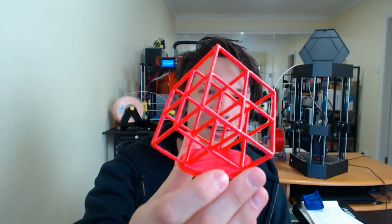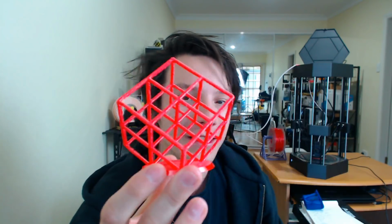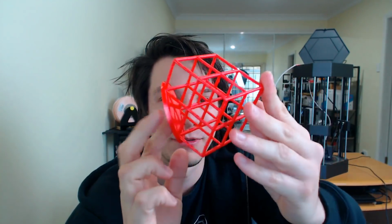Right. So what we've got going is the Flux Delta Plus. And to show you what my previous test was, this was what I got last night. It's better than what I got in the review, but it's still not great. I think the cooling on the Delta Plus could be better, but also it looks like a little bit of over extrusion, which is why I wouldn't have minded tweaking the filament multiplier. But yeah, that's how it is.